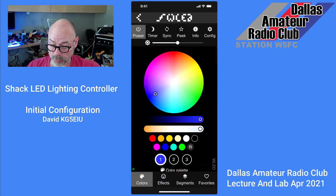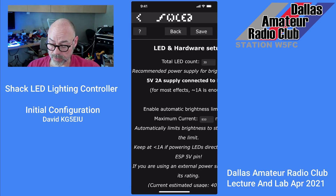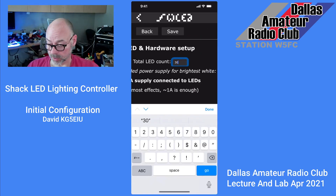One thing you want to do is go into Config and set your LED preferences. This strip here that I'm using in the background has 100 pixels to it, so I would want to set my pixels to 100. The lab strip you have is actually 20 pixels long. Go ahead and click Save on that.